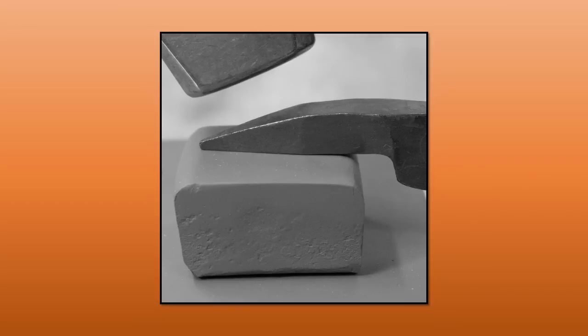Once you've got your half-inch square, we're going to forge a taper down to the end. I'm showing two different sections here: a parallel section nearest to the boss and a tapered section on the end of the jaw. It doesn't have to look exactly like this — you can have a general sweep of a taper all the way back to the boss. I just want something with two distinct sections to the jaw.